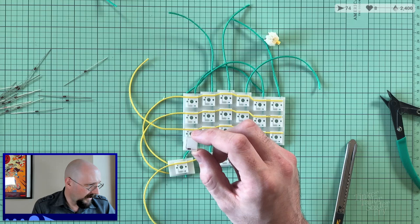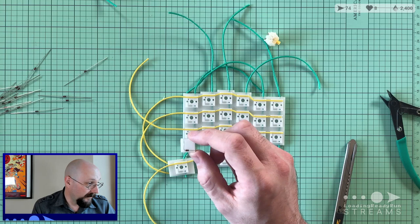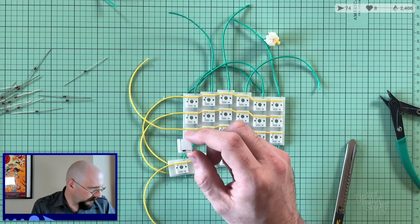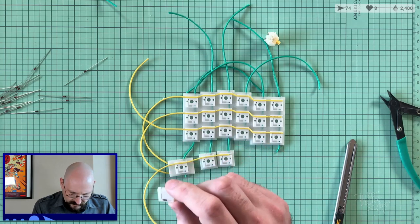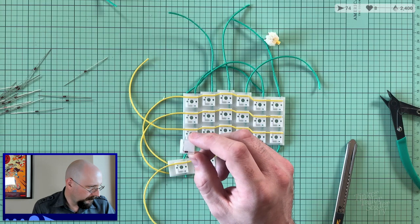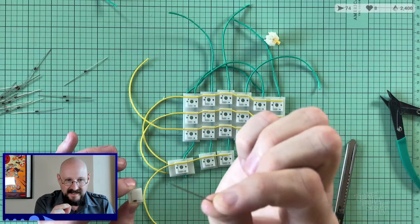And if I recall, now is when we might need to actually start making some holes. Okay. You can actually change the diode direction too, if you prefer. Okay, start by bending the anode leg next to the body. We've done that, and then go the other side. Cathode leg needs to be pushed through the column wire, but it isn't sharp or stiff enough to cut its own hole reliably, even in silicone sleeved wire. So I recommend using a sewing needle or pre-piercing a hole. Well, guess what I have handy here? Yes, a tiny, tiny sewing needle.